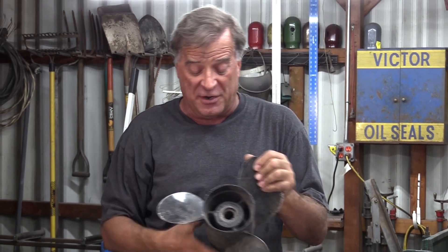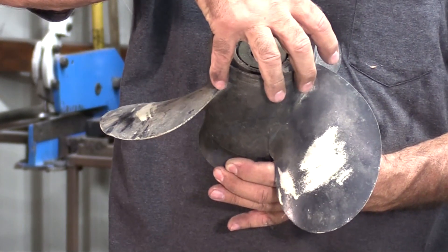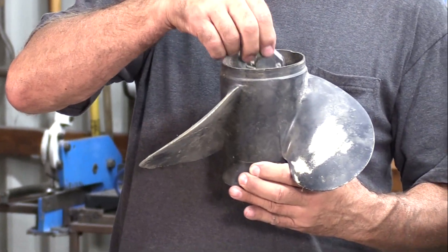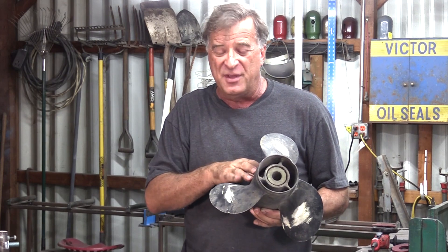But there's definitely a lot of mass right here, something very heavy here. But you look on the back side — wait a minute, there's two different metals right here. This center spline has been pressed inside of here. Get out your magnet again. It doesn't want to stick — not steel. Probably some sort of stainless variation simply because it's on a propeller, it's going in the water. They don't want it to rust, but they want something strong because there's a lot of torque and abuse. So it's more than likely an aluminum propeller with an aluminum hub with a stainless insert pressed down inside there.